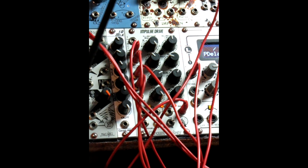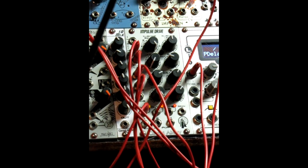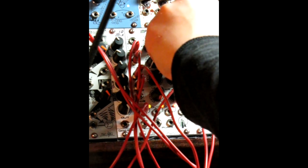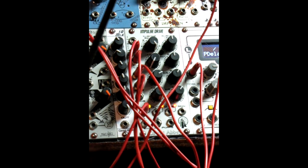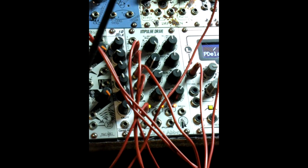I'm now going to plug into output 1 and we will hear what the kick drum going through the first grid sounds like. I will also turn the CV level to nothing, so you just get what it's doing with its current grid bias setting. And just for fun, let's sweep around. That's a good example of weirdness — you have the kick drum actually falling out, and then this weird, nasally rectified squeal coming in during what's between the kicks. Another weird example: it's entirely killing the kicks but bringing in this groan.